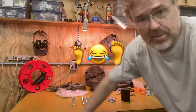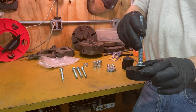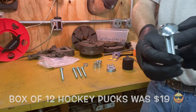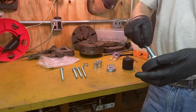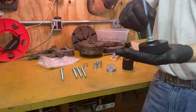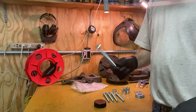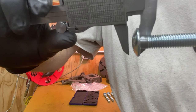Let's make some feet for the lathe. I'm going to use the hockey puck method — there are several people on YouTube who have described this. The long and the short of it is you drill out an access hole that goes through, then put a washer over top. A lot of people use lag screws and want that square to adhere in the puck, but I want it to be able to turn so the rubber foot can stay stationary while the rod rotates as we go up and down. So I'm going to take the lathe and knock the corners off the bolt so it's round. I'm only going to do one bolt until I make the whole thing and see if it works. I'm going to make the depth of the hole 400 thousandths, about that far below the surface of the puck.